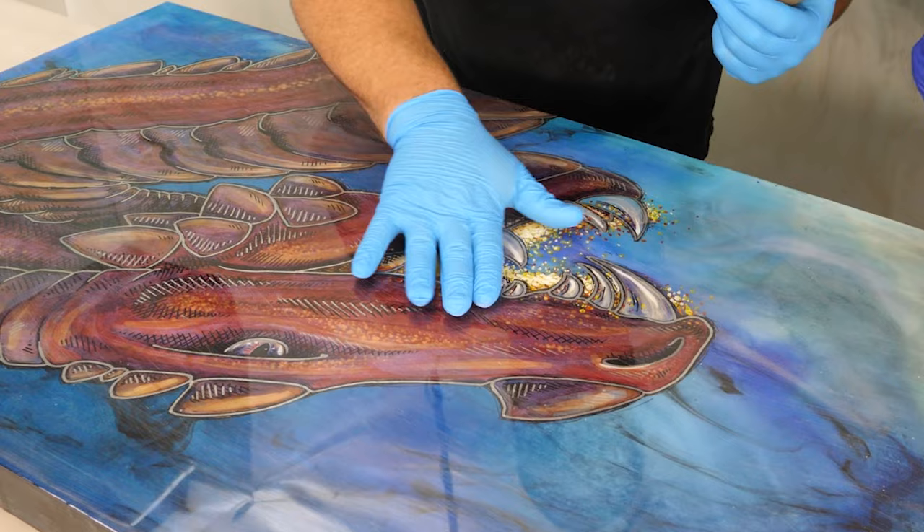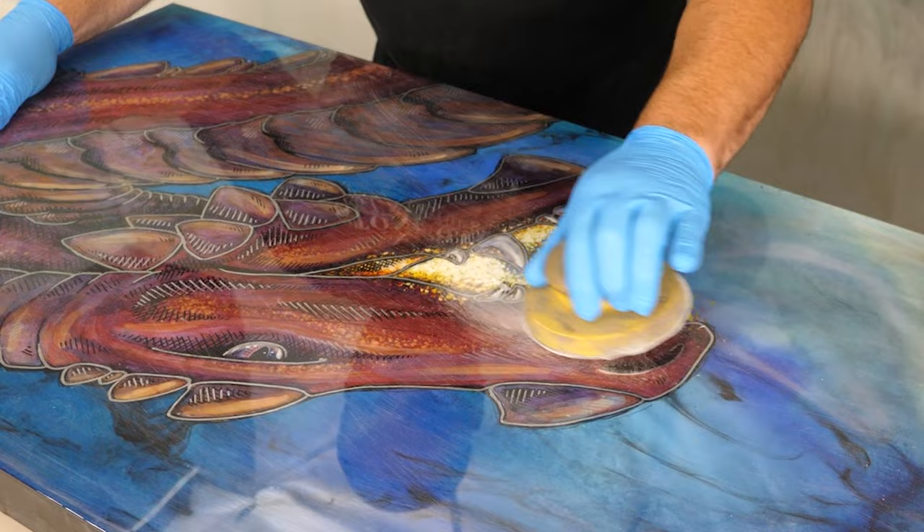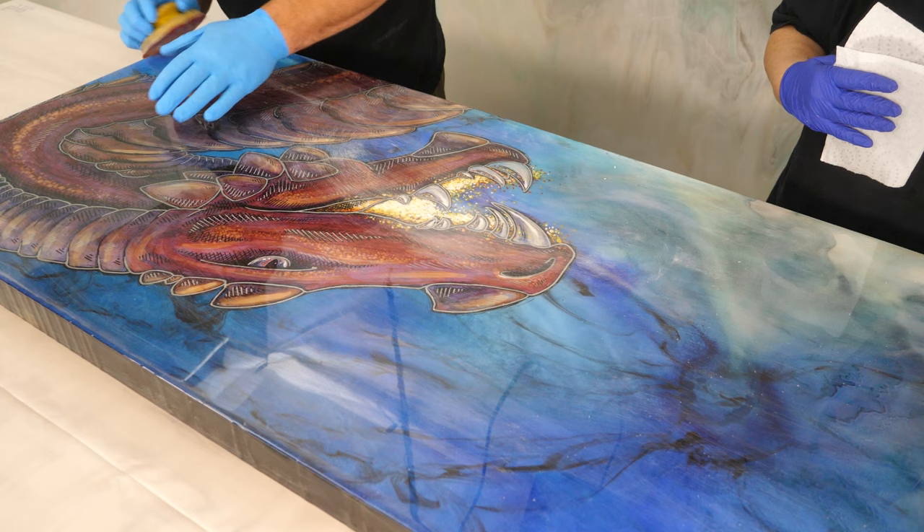Right here we got a high point. I felt that on my sander — I didn't even see it till then. All you got to do is focus on that, knock it down. Got it opened up. Once you open it up, the next layer of epoxy is going to go in there and fill it up. You will never know it was there.